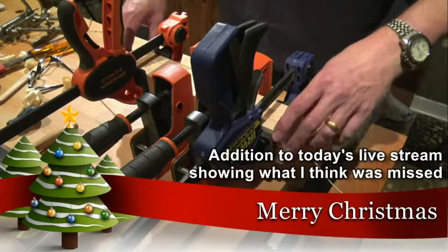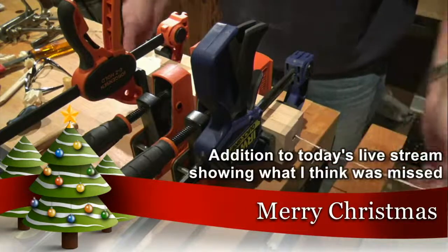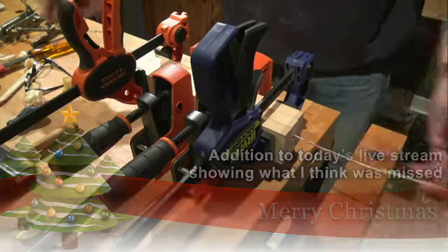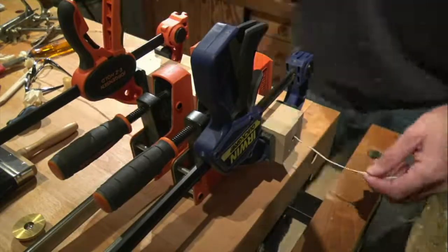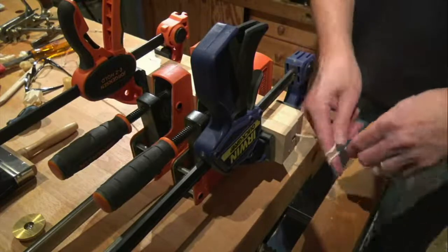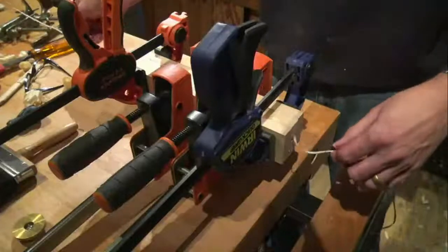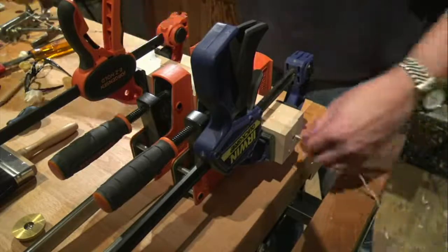Having glued these three bits of the stem up together, I've got the cable in the middle through the hole to make sure that I can still get the actual lamp cable through later — make sure no glue locks up the hole. What I'm going to do is wrap a little pigtail on there, pull it through like that. That'll just help to get in all the corners through there and scrape the glue out.